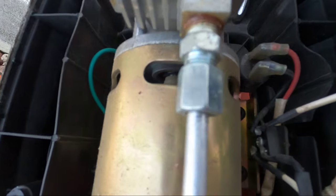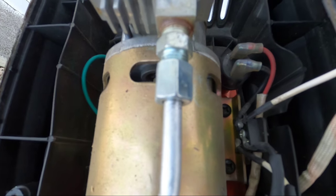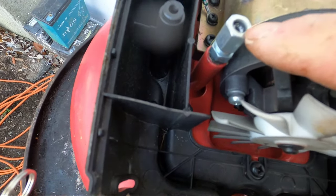This thing is noisy, it vibrates a lot, and if it wasn't snug from the factory it could have loosened up. Like I said, I've had it a little over six years and it does get used. So I'm going to snug this up, turn it on and see if the pressure builds up. Well, that was quick — I found the problem. It wasn't over here, it was down here. This pipe snapped at the joint.